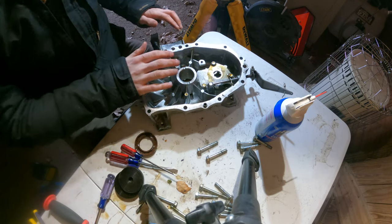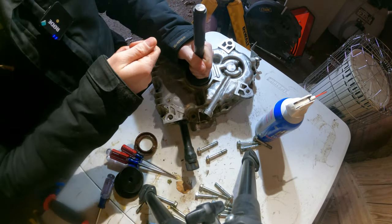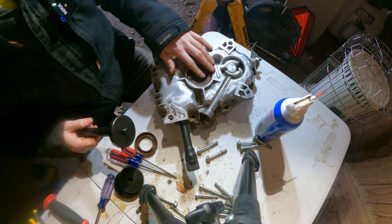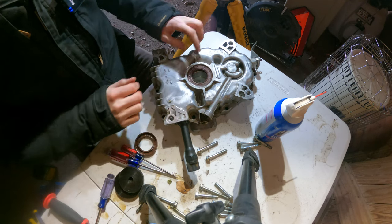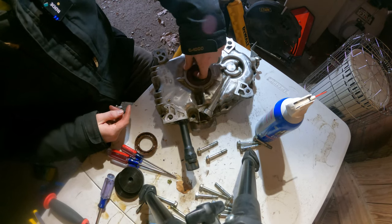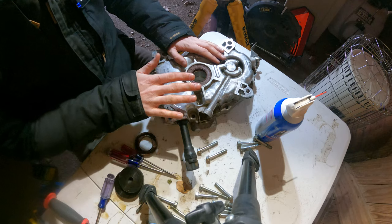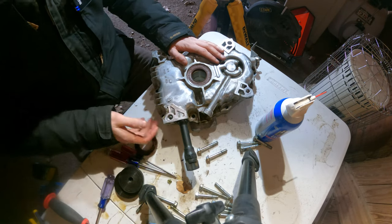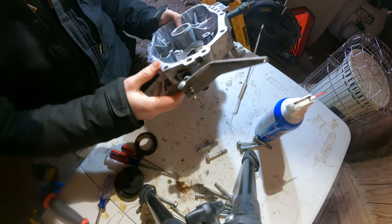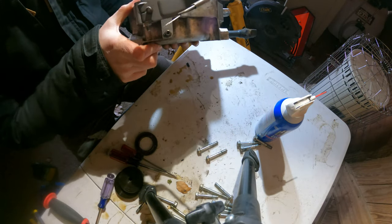In hindsight, I think a shop press would be a better tool for this job. The shock of driving the seal in with a hammer can cause that spring to fall out — which was a fiddly job to get back in — and you have less control over how deep you drive the seal. Thankfully there's a lot of clearance in this machined hole; the seal could have been sunk even deeper and the oil passages on the bottom remain open. But if you have a shop press, I think that would be better. We got the job done. I think the next video we'll go ahead and replace some more seals — probably this one here attached to the oil pump. Stay tuned and thanks for watching.